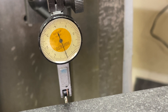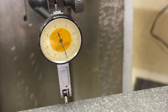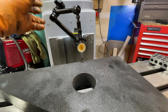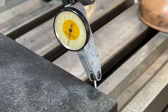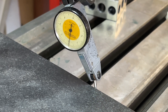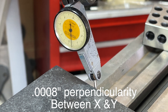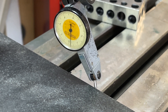I have a granite square on the table and I'm sweeping the X-axis with my tenths indicator. We've got zero there, so I'm just going to bring the table to center and turn my indicator to set it up on the Y-axis. Let's zero this in. Y-axis is zeroed — now let's sweep this and see what we get. The manual for this machine calls for 6 to 8 tenths within 12 inches. That's roughly around 2 or 3 tenths. Wow — I am very happy.